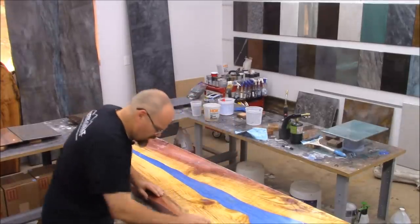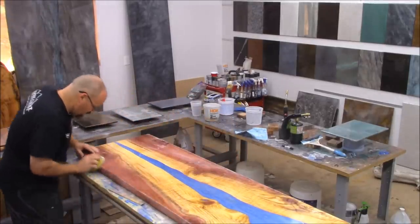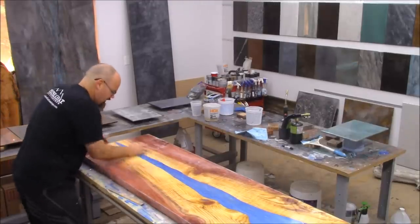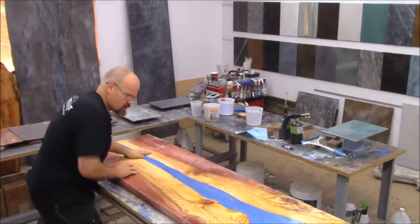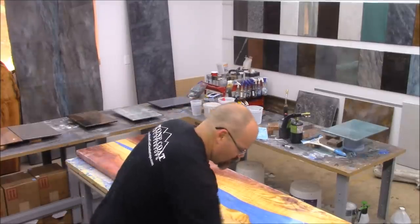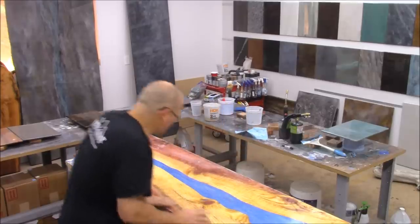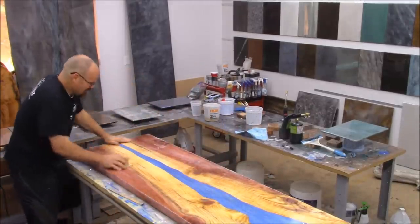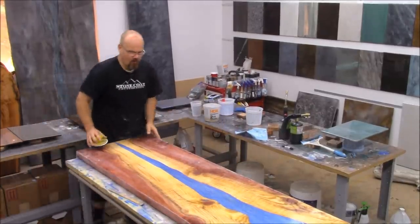After the third and final seal coat, I'm going to take my burn-in stick, heat it up, and fill just a couple of these stubborn pinholes that just don't seem to go away. Inevitably on a wood project you'll find these where a knot or crack is — it just seems like a never-ending epoxy drainer. We fill these with the burn-in stick, then use a straight-edge razor blade at a 90-degree angle to scrape off the excess, sand it, and we're ready for our flood coat. We've let this dry overnight. Sand smooth those remaining bumpy areas — be careful not to go through what you've already done on those edges. Getting it nice and smooth helps the flood coat go out like glass. Sand all the little nibs off these edges — you'll feel them with your hand and a couple passes will make them nice and smooth.